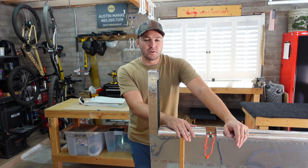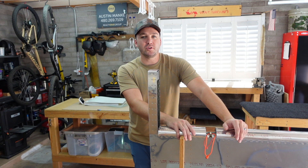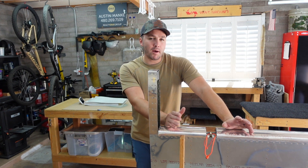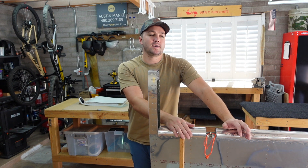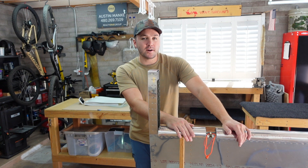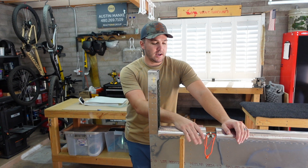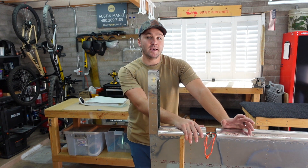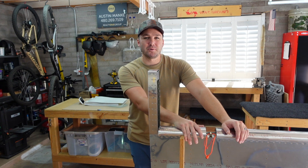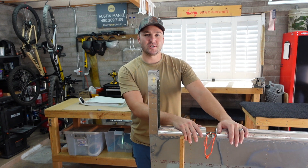This really isn't the hardest thing in the world to do. A lot of people won't be doing the service bulletin because it gives you the option to just check for cracks. In a painted aircraft you'd probably be more likely to see those cracks, but we're not sure if we're going to be painting or wrapping. I know vinyl wrap would hide cracks, and if any portion of the airframe has a potential for cracks that could be hidden, I'd like to know or at least address these service bulletins ahead of time.